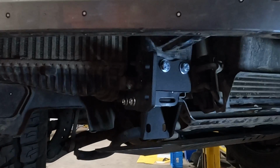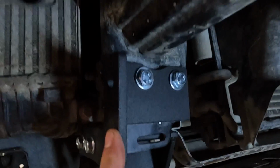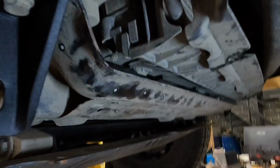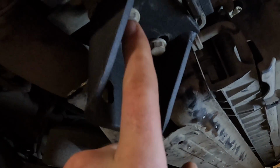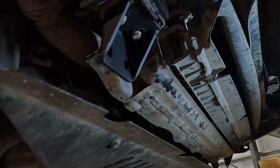Right, so we're just showing you installation of the Touareg front bumper bar. Bracket's gone first. So the main bracket obviously goes on the front crash bar here, 2 M10s up in there, and then we've reinforced it on the sides, 2 M8s there. The lower rad support arm here, we'll take the M8s out of there, and then we can put this bracket on underneath. This one's tight, this one, keep it loose, and then we'll offer up the bar and we should be able to bolt it up then.